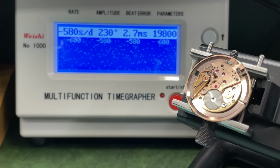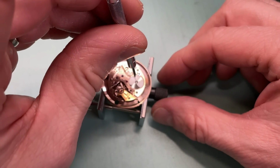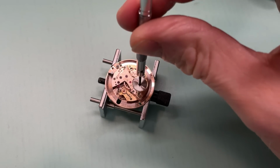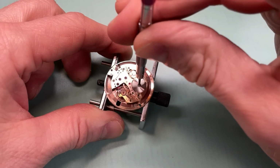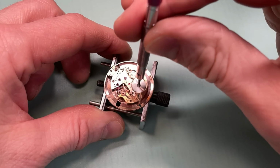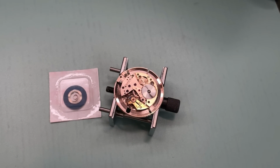And there's a reason for that, or at least I think there's a reason for that, and I'll just try to show you. So on the bench here, if I just try to put the screwdriver in here, I realise I'm going to lose focus. And if I just try to wind that, essentially all that happens is it winds and winds and winds. Never really, I feel, much resistance. There's power going in, but not a lot. So to me, the mainspring was either set or it's just got a bit of a problem. So I bought another one. That's why it's taken 3 or 4 days to get back to filming, and we're going to install that, and I'll see if that makes any difference. I really hope it does, because otherwise I've got to start fault finding.